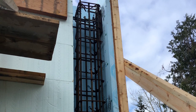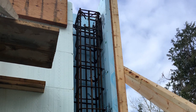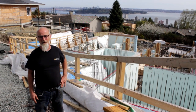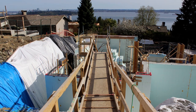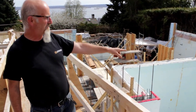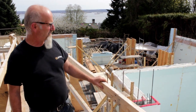One of the interesting things was the free forming around the regular ICF blocks. The engineer designed that we need a 14-inch pilaster to support all the steel up above, so we should go and look at that — it's quite interesting how it came together. This is the first pilaster that we did. You can see it's actually on the other side of a doorway, which made it a little bit easier to construct.